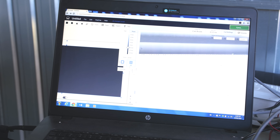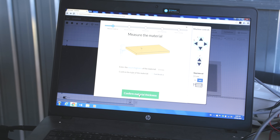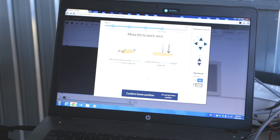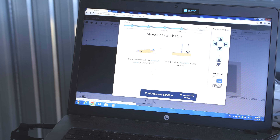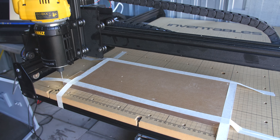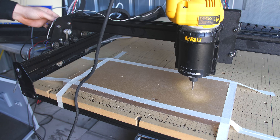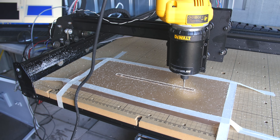First I'm choosing the material depth that I want to cut into the piece of acrylic — I chose 10 millimeters, so it's going to mill out 10 millimeters of material from my acrylic. Setting up my CNC machine, telling it which bit to use, and then putting the CNC machine in place ready for action. All I have to do is hit cut and then wait for the project to finish. This current project is going to take a while because we've only just finished the CNC machine and we only have the one bit.